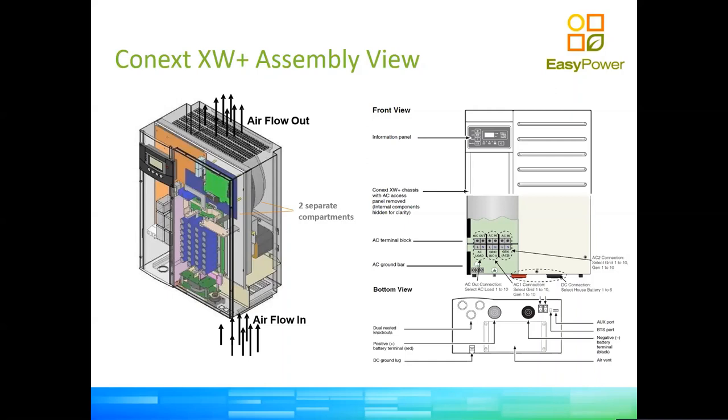So this means that in this inverter, you do not need to bridge the output neutral to earth. Not necessary. I know that in some of the cheaper inverters, that's necessary because of the double conversion that takes place inside of the inverter. This inverter, it's not necessary.